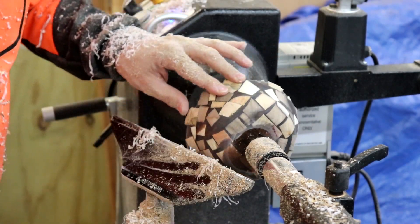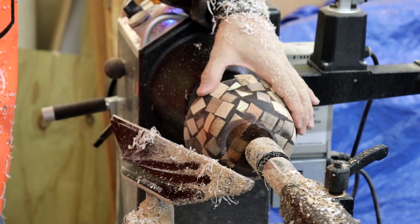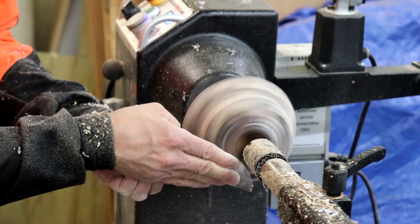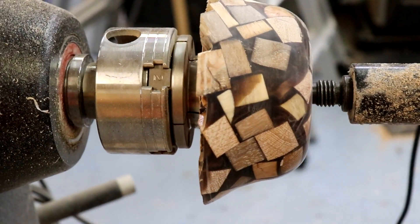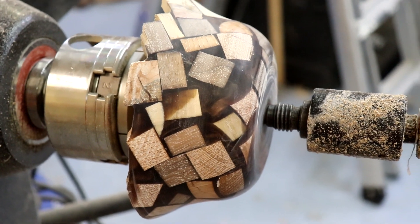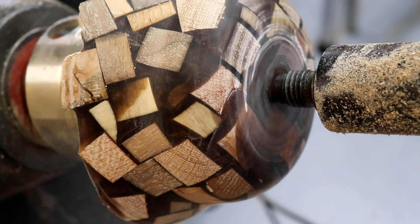That has removed all of the tool marks. I am amazed at the surface quality that this EasyWood Negative Rake Scraper puts on the bowl. I'll still sand it, but it's certainly not going to require much sanding work. I'm also going to take care of cutting out the recess. I've got it sanded out now to 1500 grit and I am loving the surface finish — it's just absolutely smooth as glass. I'm going to now remove the tailstock; I left it in place to keep vibration to an absolute minimum while sanding.